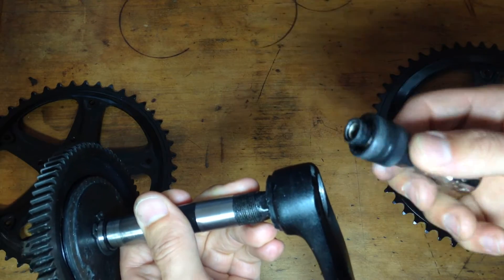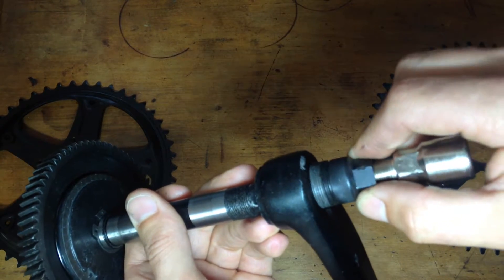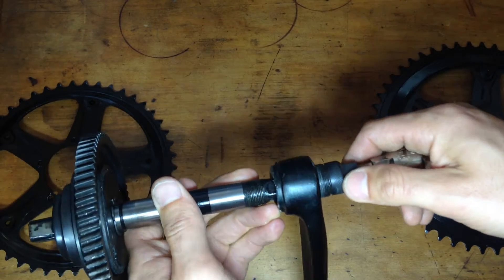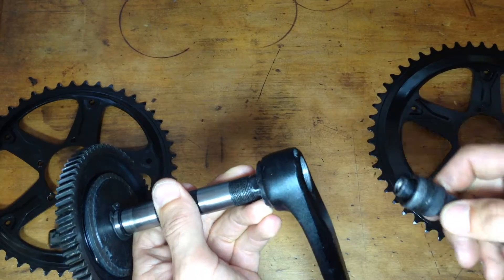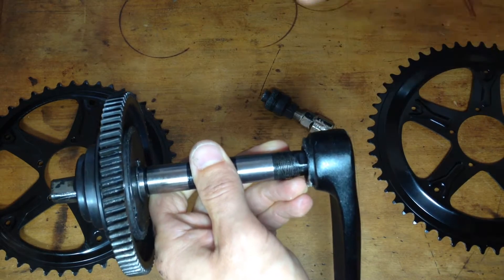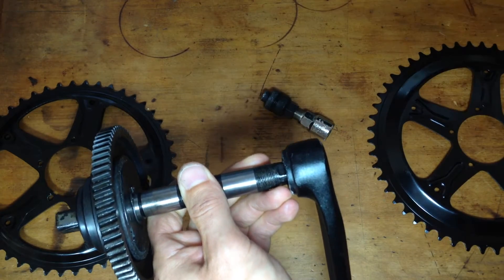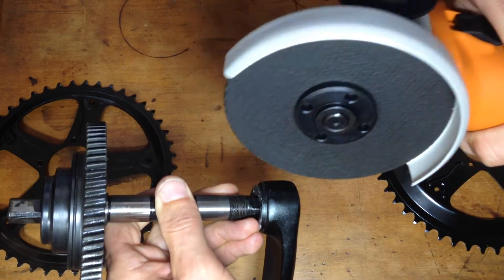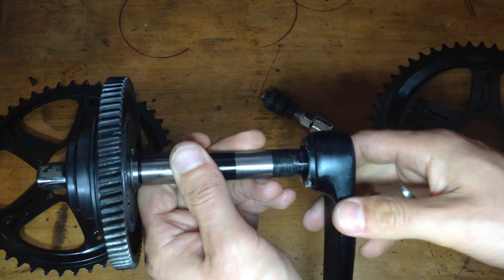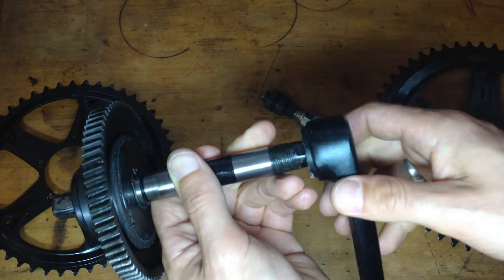This tool is made of steel, and you're screwing a very hard metal into a soft aluminium bar. No matter how careful you are, you end up damaging the thread inside. If you damage the thread, you're in a really big problem. My first time, it took me one and a half to two days to figure out what to do — it's not as simple as just cutting it. It's a square shape and it's really hard to understand what's happening.